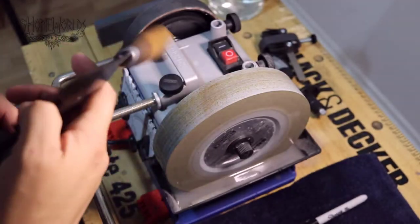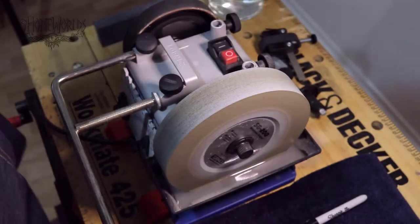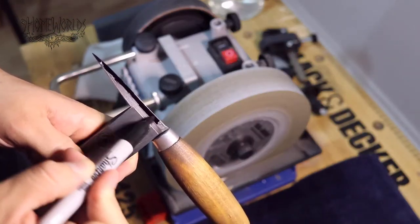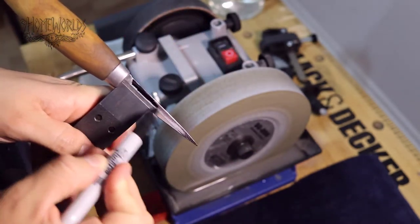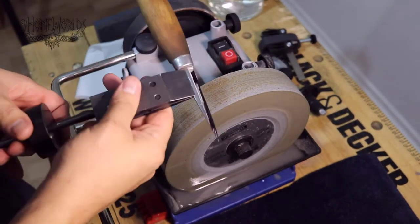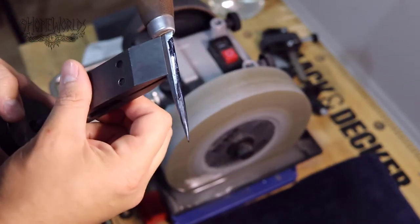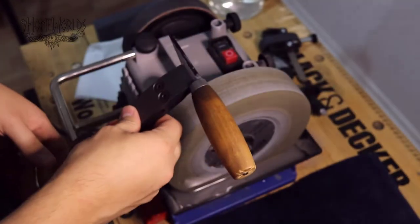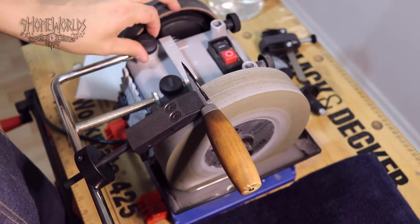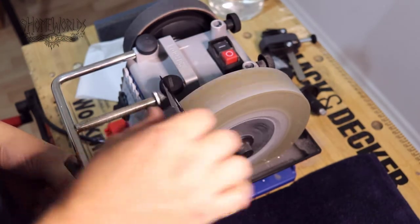This was getting a little frustrating because one side was so dramatically different than the other — I kept going back and forth adjusting the length. I eventually got it, but right before grinding I blacked out the bevel again to get a fresh perspective. I rest the knife on the tool rest and manually move the wheel to do a light test grind to see exactly where it will start grinding. As you can see, it's near the top on one side and the same distance near the bottom on the other — close enough to the middle. I tighten the jig rest and we can begin.